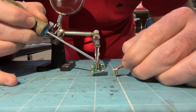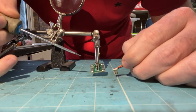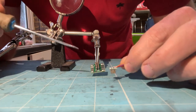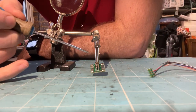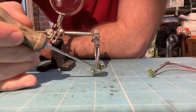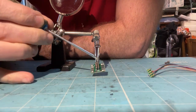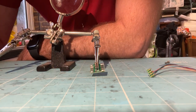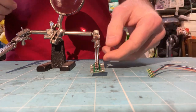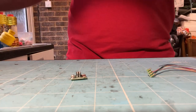The red and black ones are the other two diagonally opposite tabs. It doesn't really matter which way around you do red and black because you can reverse the direction of the model using CV29 on the decoder. So the two terminals — the one with the little 'O' and the one diagonally opposite — need to be attached to the motor, and the other two diagonally opposite tabs need to be attached to the track. That completes the circuit when we plug in the decoder.